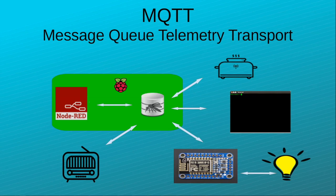The radio and the toaster are just simple Arduinos. They're ESP32 sketches that run an MP3 that's stored on an SD card. The sketch also listens to an MQTT topic and returns the status of where each one is, so that Node-RED could coordinate when to start the other party in the conversation. There's also a little bit of random lines, because in the show, Talkie Toaster pops up all the time asking stupid questions related to toast. So it would do that, and it was going to do that in my presentation also.